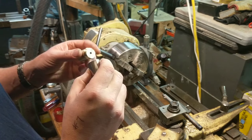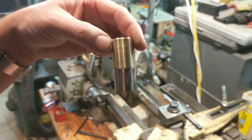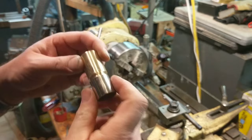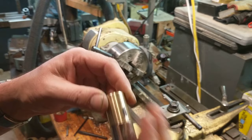What's not so great is that the tap they used - I think they must have used a tap to tap this ferrule - it went in sideways, it went in cockeyed. As you can see, that thing is sideways. I don't know how clear it is to you but it is bent pretty substantially. So what I've done is put a Sharpie mark at the point that it needs to rock in order to straighten out. Like here - this gap needs to be closed upward.